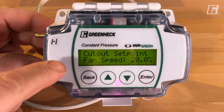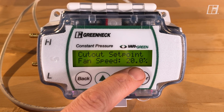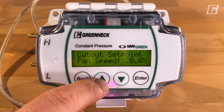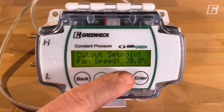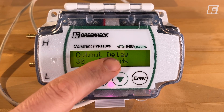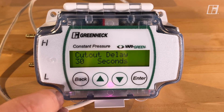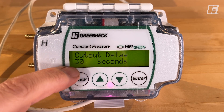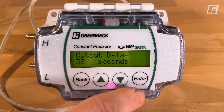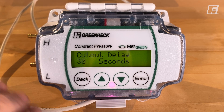I'm going to hit enter. The cut-out parameter is the set point when the motor goes below two volts or below 20%, meaning the control says there's no demand on the system and will shut down the fan. You can set that to 20, 21, wherever you need — from the factory we're at 20%. The second cut-out parameter is the delay: if we need less than 20% of the fan's capability to maintain our set point, we enter cut-out. This is the delay or purge time that keeps the fan running to clear any warm air out of the ductwork, and you can set this in one-second intervals. After this 30 seconds, the fan will stop and wait for the pressure to change.